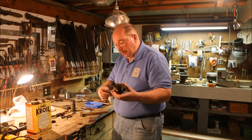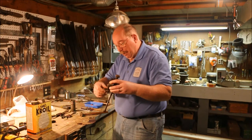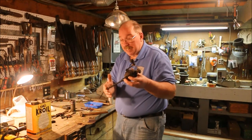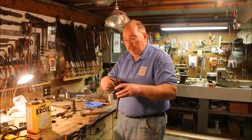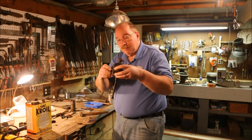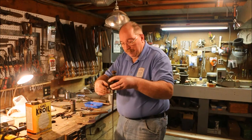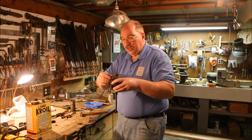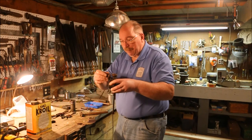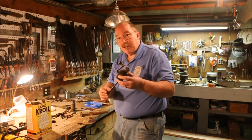This is a tool for grinding valves on a car, lawn mower, motorcycle engine, whatever. You put a little grinding compound between the seat and the valve, stick this in a slot in the top of the valve — sometimes they have two holes, sometimes a slot, sometimes nothing and you have to use a rubber cup. When you crank this, the end rotates back and forth, not around and around. The cool thing is it doesn't land in the same spot — it goes back and forth but always advances a little bit more than it backs up. That way the valve spins around in the seat but does the scrubbing action as it does it, and the grinding compound goes in and actually seats the valve.